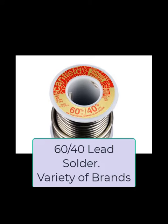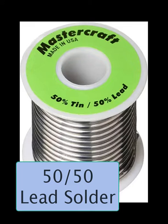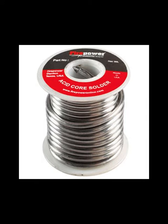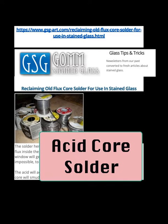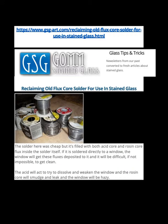There's a variety of solders. You'll see 60-40, which is the lead and tin content, and 50-50, which has to be melted at a higher temp. Acid core, resin core, you'll see. There's some things you might want to learn about that. I've not heard great things. I have personally not tried it, but here's a website that you could follow.